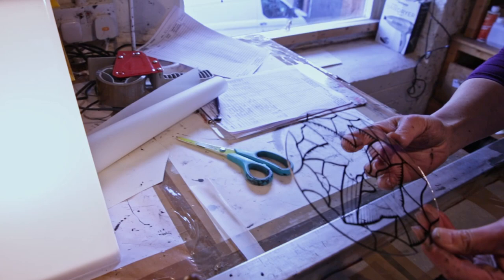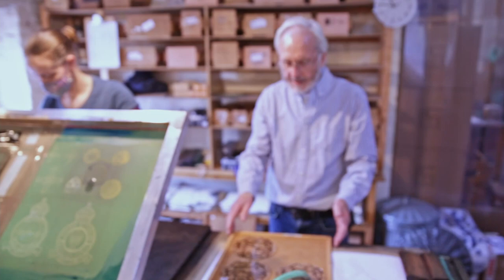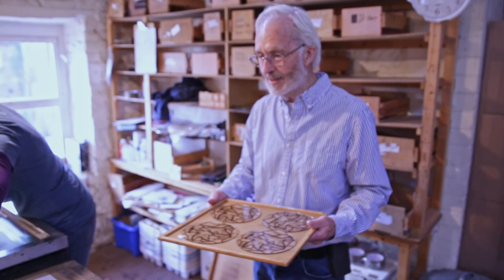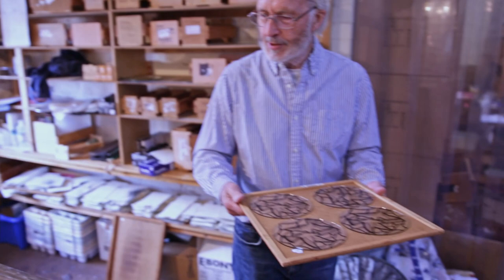So as you see, we're accumulating this. This tray, when it's finished, will then go into the oven to bake it up to a high temperature, which you have to do, because otherwise the ink might come off when you do the hand painting on it. So we have to bake them on. It stays sticky. So, yes, if you don't, it will stay sticky, as Emily just says, and you can't paint on it. Emily should know, because she's our chief painting person, as you will see.